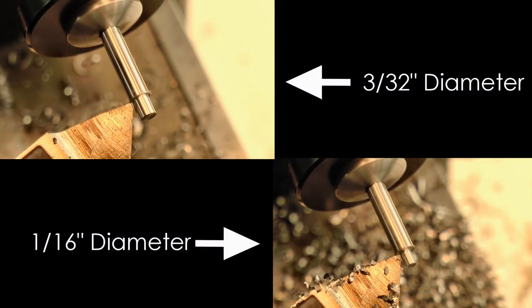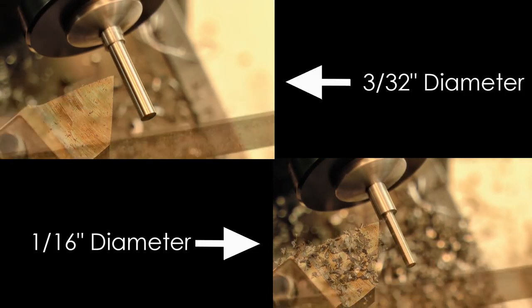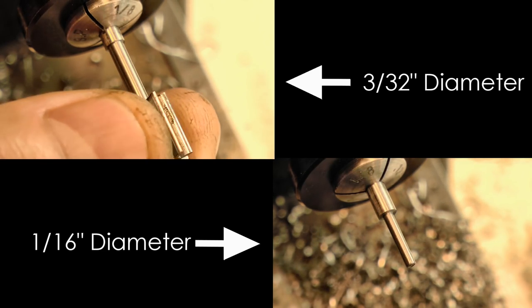Next, I turned 2 of the shorter runners down to match the pinions on the clock that I'm working on right now. I'll have to do this again for other pinion sizes in the future, but these sizes at least I know I need now.